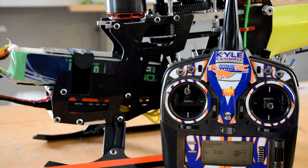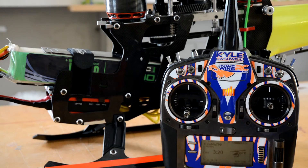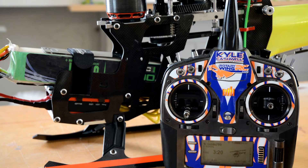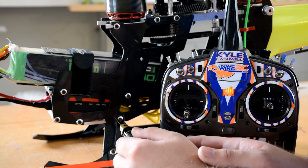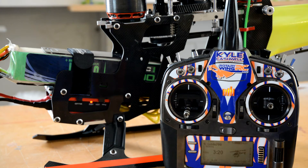Now that we've got Mode 4 done, we're going to do this one more time. Make sure your throttle is down and plug in your pack. This one is relevant for all the people who have done the new update. This time we're going to go to Mode 10, and that's how you set your BEC voltage. Otherwise you have to do it through a PROG disk or the PROG unit.